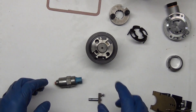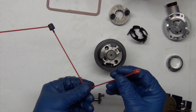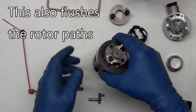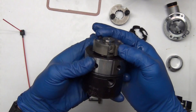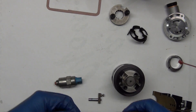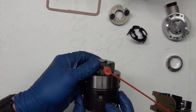I'm going to put this all back together, but first I want to do a little demonstration. I built a little jig out of straws and spray nozzles. I marked this one with a blue pen on one side, so whenever the blue mark lines up with one of these outlets, it'll inject out that side. Safety glasses are on — if it's lined up on this side, it should spray out toward you.